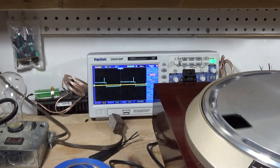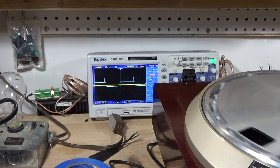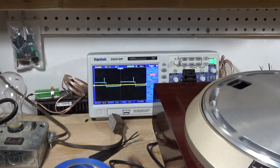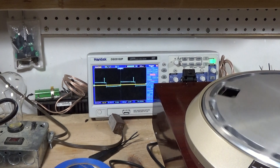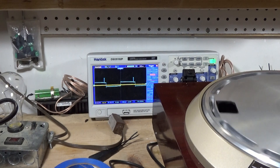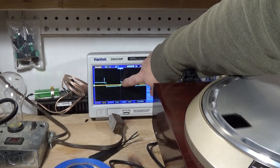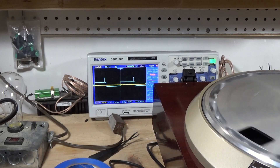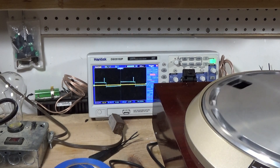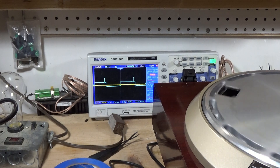I don't know how stable this is. I'm going to let it run for maybe 15 or 20 minutes just to make sure it doesn't take off, because it has done that. It looks to me like 33 seems to be stable right now. I still don't have a strobe, so I'm not sure what's going on with the strobe flash circuit. From what I can tell in the service manual, there's an IC that controls that - right now it's just a red light, there's no strobe at all. I'm not sure if the jagged edges on that square wave are normal - I'm not a square wave expert. There could be an issue with variable resistor 2, which is the 45 variable resistor. It could be bad - I'll pull it tomorrow.